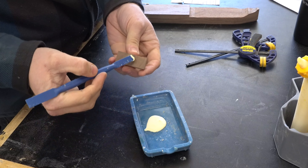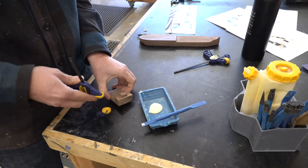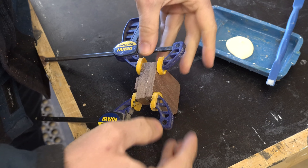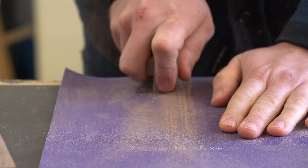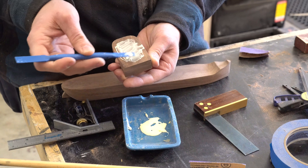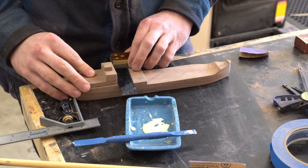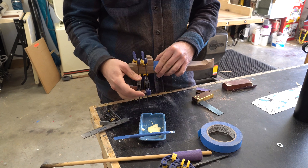I like to work with a little spatula when I glue up small parts. I'm also being careful not to get squeeze-out — I might get a little bit but I want to minimize it as much as possible. These elements will be reinforced later so it doesn't have to be a super strong glue joint. I sand the edges flush, then add a bit more glue. Using a square I can make sure the bridge is in the right spot, and then I add a bunch of these tiny little clamps.